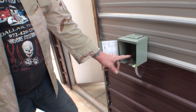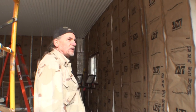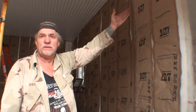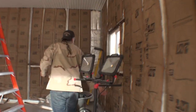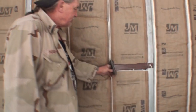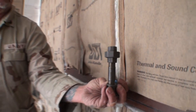We probably won't even use 15 amps because all we're going to do is run LED lights and an exhaust fan, and possibly a buffer or a portable heater, so 30 amps is more than enough. I just got done mounting this box on here — the cord will come up here and plug in there. I was going to run air line all the way down the wall and over, but decided that's a waste of time. The more connections you've got, the more chance of leakage. You can see right here where all my air filters will hook up.